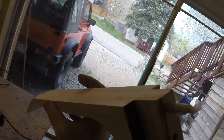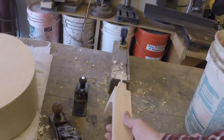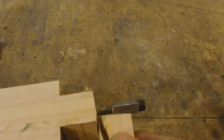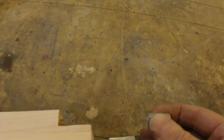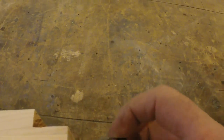It looks pretty darn flat. I'm pleased with that result. So onto the next thing: the block that I'm using is that thick, and there's a piece under that about three-eighths thick. If I leave it in this area somewhere, that's going to be a good place to grab it. I could weld these two connector nuts — banjo nuts — together. Or I could probably weld this cap bolt in here. I'm still left with what to do here if I don't weld them together, and I don't want to do that. So what I did was, I have a piece of half-inch tubing and I went ahead and knocked it down a little bit so it should fit into this hole.